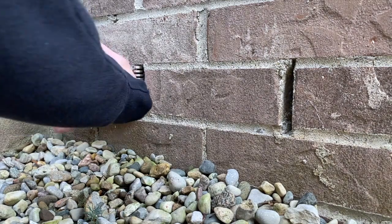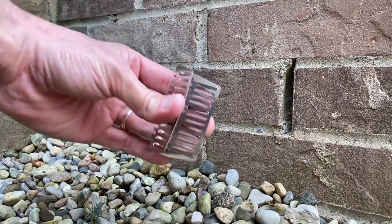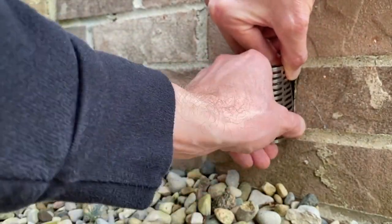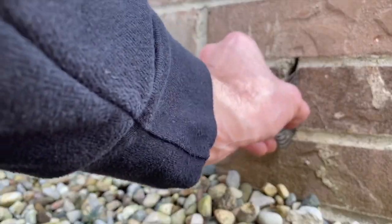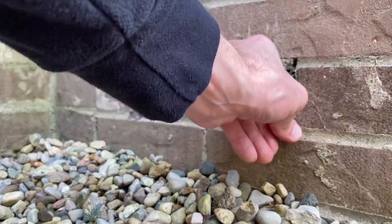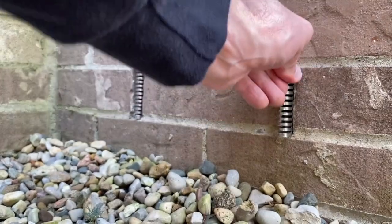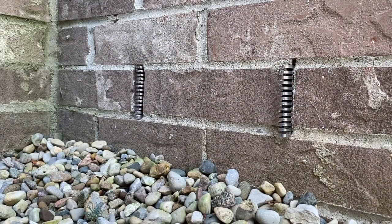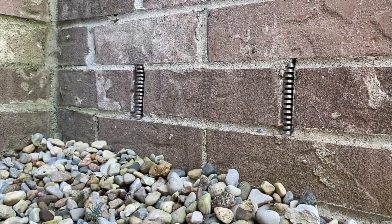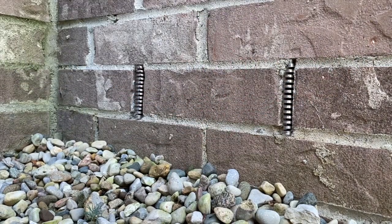At that point, you can give it a couple of taps with your hand. I'm pretty satisfied with that. Now shifting over to the thinner or more narrow weep hole — same thing, just compress the weep hole screen. I'll use one hand on top, one hand on bottom. Come in at an angle, really get that bottom portion in, then come up top and do the same — compress and shift in. Come back down to the bottom, compress, shift in, back to the top, back and forth until you can no longer do it by hand. Because this is aluminum and very easy to bend, as I shifted this screen in, it began to shift and bend with the relation of the mortar here, which is kind of cool.